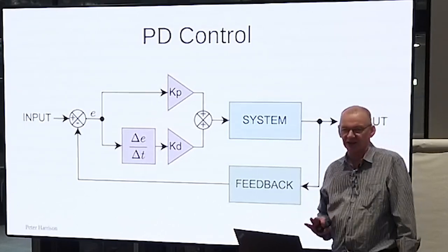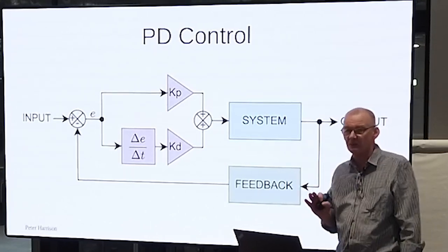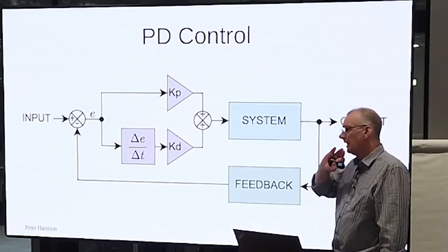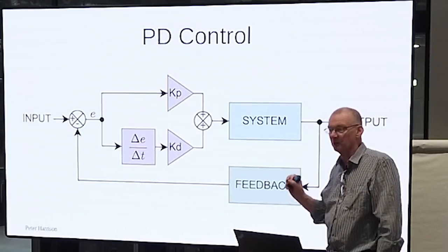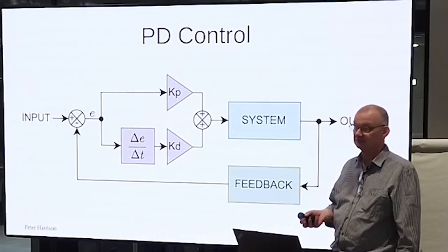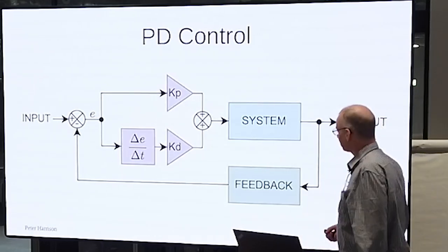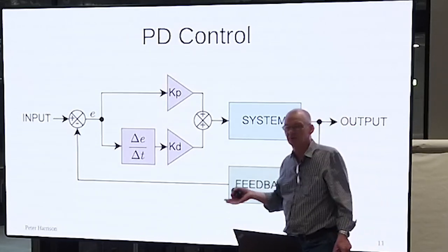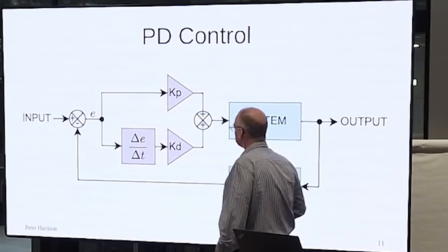Well, take my word for it for the time being, you don't need a PID controller, but you probably do need a P and a D part, right? The integral part has its place for different kinds of problems and can be an essential part of the solution. And in fact, if you couch this problem in different terms, you might end up with a PI controller. But that's not what we're doing, okay? Maybe you'll see, maybe you won't, I don't know. So this is all very well. This is classic stuff. This is what you'll find if you go and look about, or if you think back to those lectures from your dim and distant past when you were dreaming of the summer.